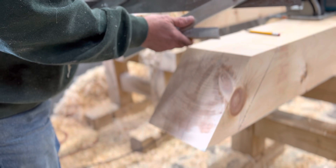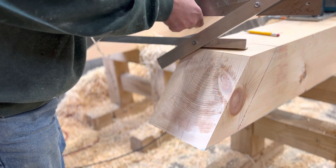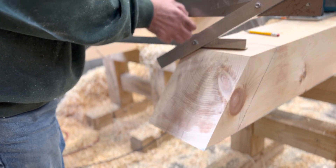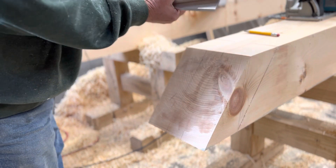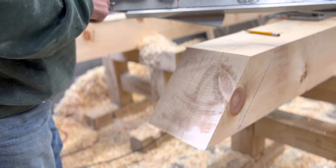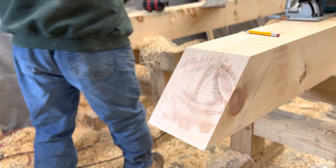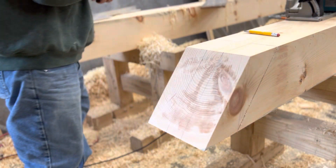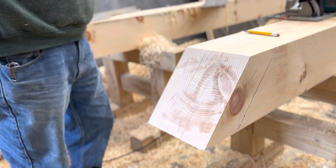The other thing you can do with this real quick is you could take this piece out at two inches. If you wanted to make a three-inch tenon, you could put a three-inch piece in here. You could put a one-inch piece in here and it will be centered every time, as long as the holes in the back are exactly in the center of your measuring device. Give that some thought — that's a really slick tool, easy to make. And once you start using it, you're going to say to yourself, why did I not have one earlier?